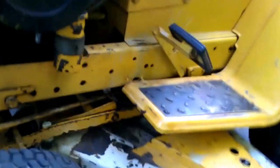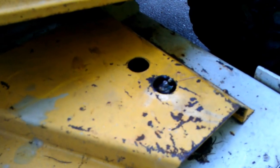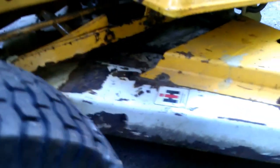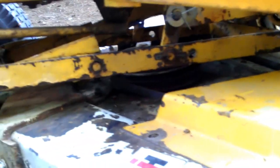Underneath the tractor, you can see the mower deck. I went ahead and lubricated the Zerk fittings — there's one on each spindle, and each spindle seems to turn free. I'm going to rotate the belt. I also attached this scissors frame that allows the lift to raise the deck up and down. In the front — I call this the mule — these two gears take the belt off the PTO, and there's a spring unit that tensions the belt. They were a little tight but I lubricated them, and now you can see it spins free, so the bearings freed up.